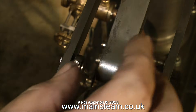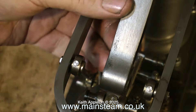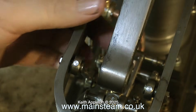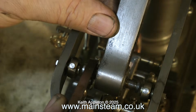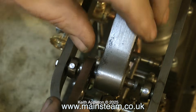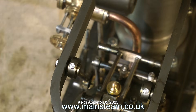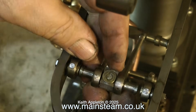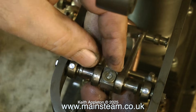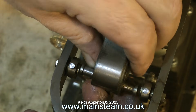I don't intend to move the position of the center shaft again. It's looking like there's just enough slack in the center bearings to move the beam across a fraction more — and I do mean a fraction. I need such a small amount of movement to the left. It's an optical illusion really, because the builder has removed some material from the left hand side of the beam but not from the right. When I temporarily fit one of the original pins I can see how much better the main beam is — it's lining up with the center of the piston rod — but neither the beam itself nor the piston rod are lining up with the sides of this horseshoe shaped piece of metal.